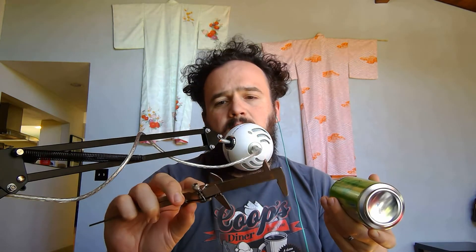This is just a standard soda can, and I'm going to use the calipers and open them up. When you're measuring a cylinder, you have to be careful that you're going all the way across. When you're measuring any circle, you want to make sure that you're measuring the widest part. You can close the calipers a little bit and see if the can fits through — if it doesn't fit through, make it a little bigger until the can just barely fits through. That'll be the diameter. If you're measuring with a ruler, just keep adjusting until you get the longest measurement across the circle and then you know it's the diameter. The diameter of a soda can is about 66 millimeters.